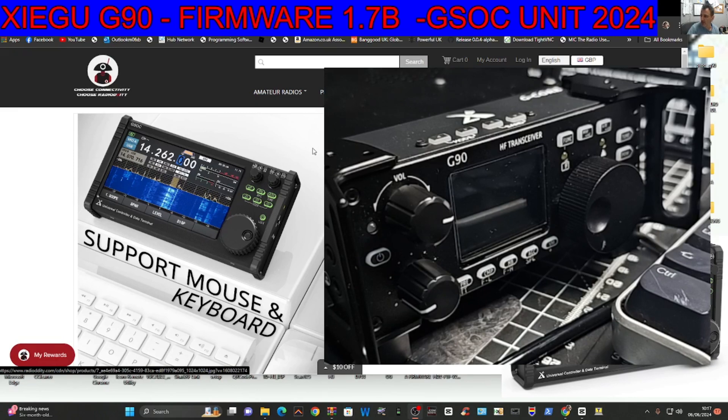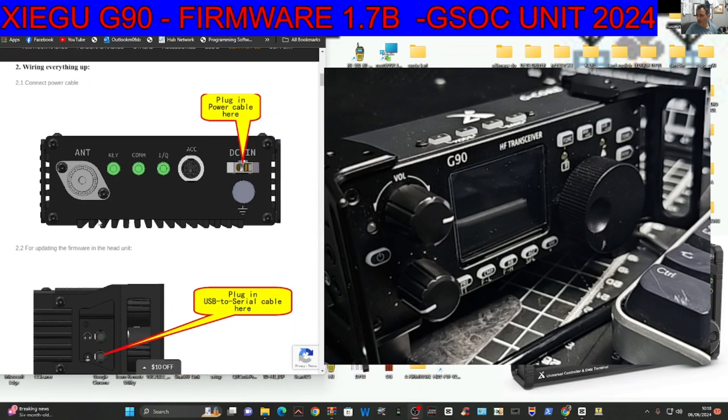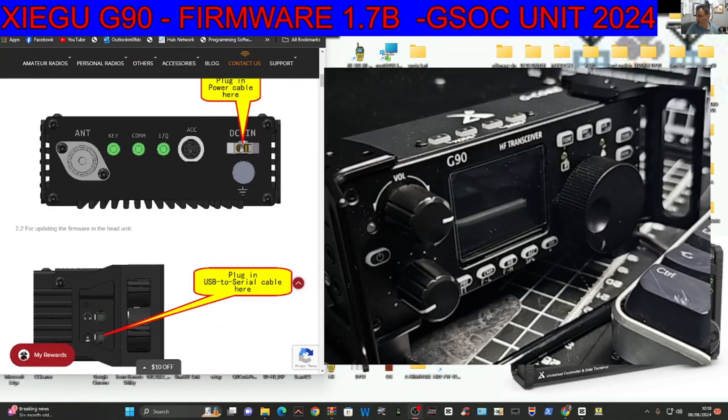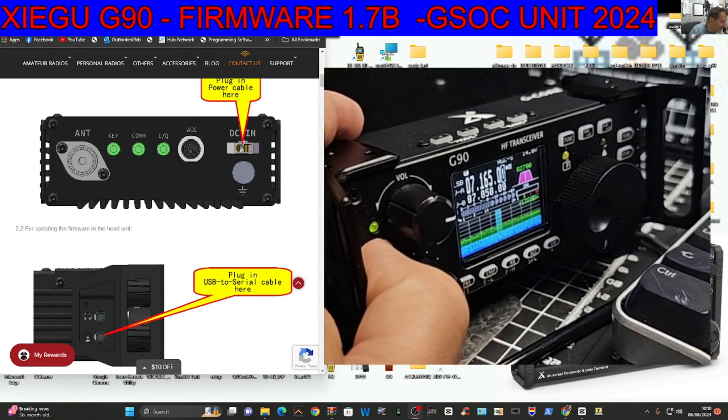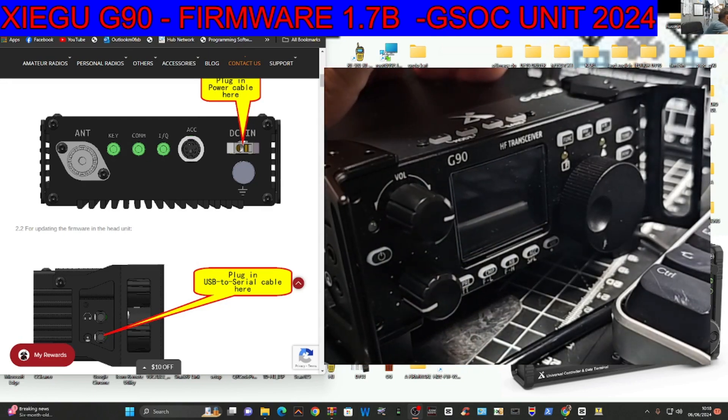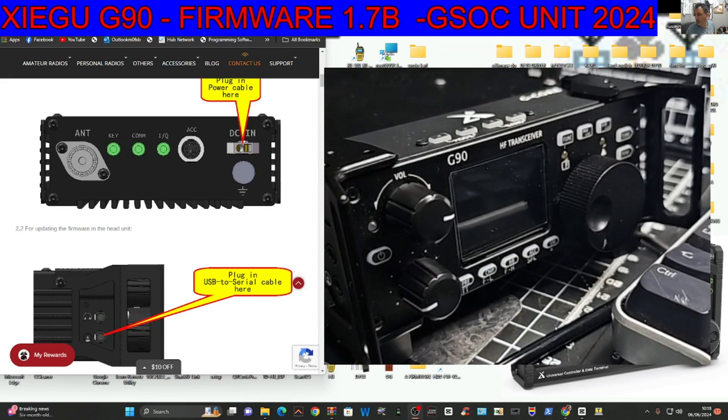I spoke to Radiolity and they've told me to use the 1.79B firmware, so that's what I'm going to do. I'm going to load it in, although it seems to be working fine — the front unit is 1.8 and the main body unit was 1.79. But I'll do as I'm told. The only tricky bit: before you start, turn off the unit, wait for it to say bye, then pull out the power cable. You want it completely dead each time you do the firmware.